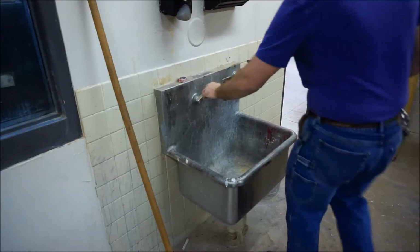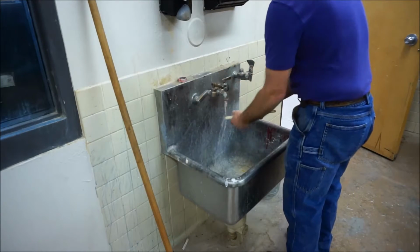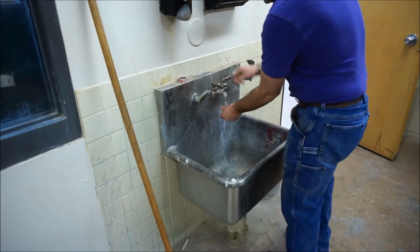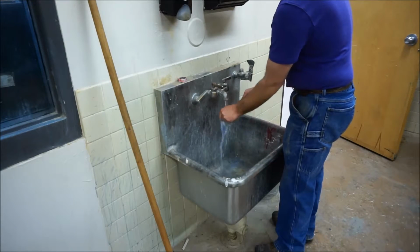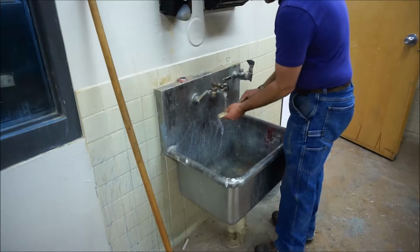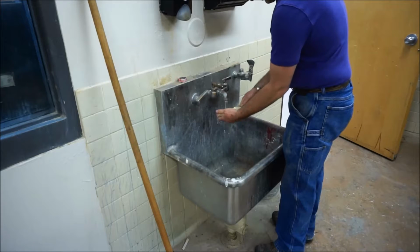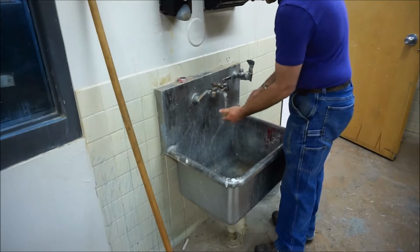Of course, once you are done applying the polyurethane, it's time to go ahead and wash the brush. Make sure you run the brush under cold water and brush out and wash out and sort of clean out the brush as much as possible. The water coming out of that brush should look clean by the time you are done.